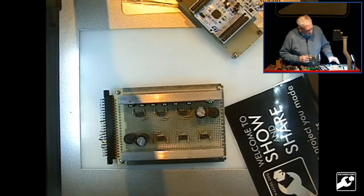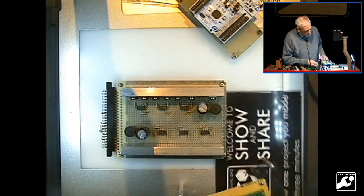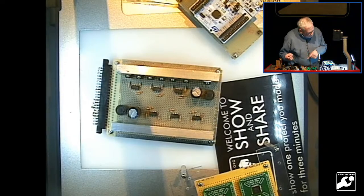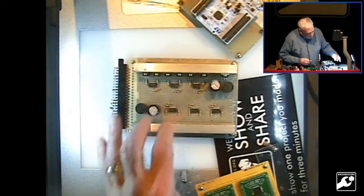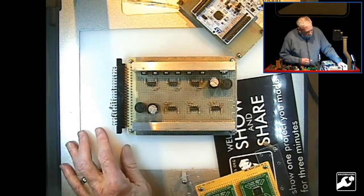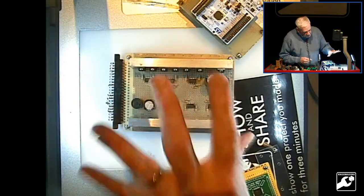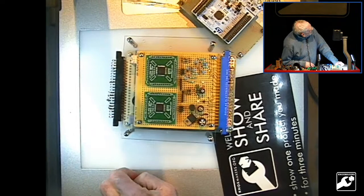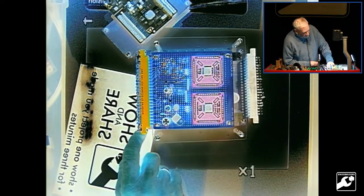This is all under construction, never been powered up, really. This is the motor controller for the BLDCs, not wired. It's got six MOSFETs. These aren't populated yet. A switch mode power supply for each motor. This is the controller board for the driver board.